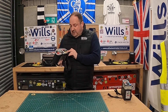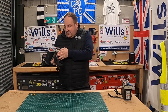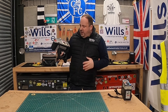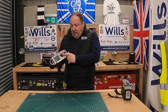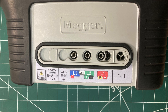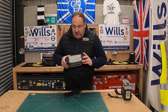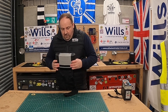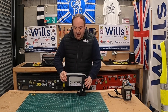There's also a touch button here - if you're doing touch current testing you can put it on that setting. I'll be honest, I've completely stolen that from John Ward's video - I only watched it yesterday to see if there was anything else to mention. Up here the blue bits are all for Bluetooth recording, but I don't get involved in any of that. Going back to the earth loop page with line-to-line and line-to-neutral - that's for three-phase testing and you've got the terminals there for that. The plug-in attachment is similar to the 1553, which is really nice, and that slider is where you plug in the 12-volt charger.